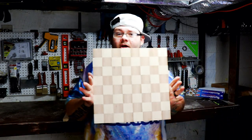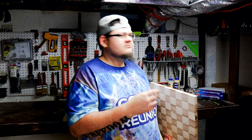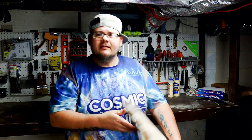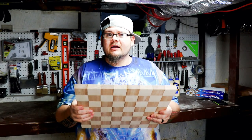Unfortunately I was not able to film at the lumber store — the person I usually deal with was out on lunch when I went, around noon. Even though I wasn't able to film, we did get our board nice and smooth. The old-school guy who works there — one of the owners — actually recommended instead of running this through a planer, which can cause some tear-out on the end of the boards, to run it through the drum sander instead. So we gave it about ten passes through the drum sander, about five on each side, and it came out really nice.